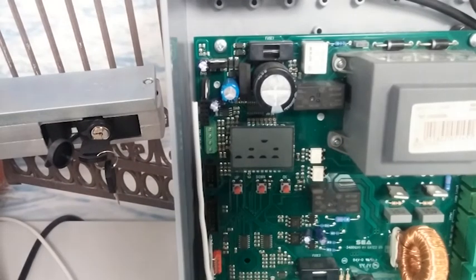Along the bottom row you have four dashes. From left to right, the first dash is photo 1. This is the photo cell that would normally be fitted to the outside of the property and is designed to prevent the gates from closing if there is an obstruction in the closing path of the gate. Photo 2 is the second dash along and is used to pause the opening motion of the gate, but it can also be used to stop the closing motion as well.